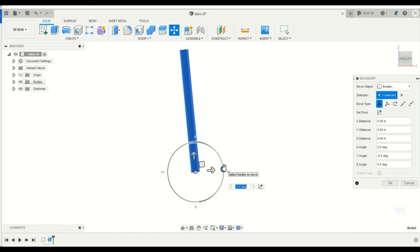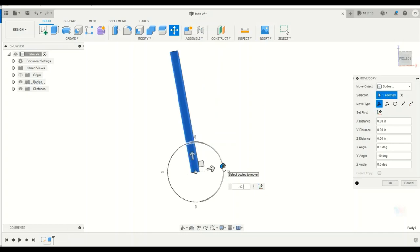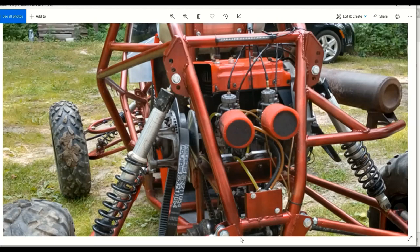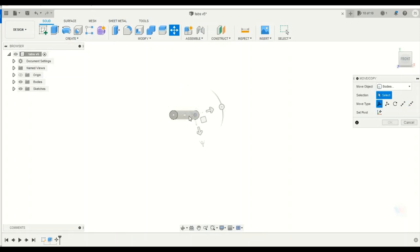I need to rotate it 10.8 degrees this way, negative 10.8, I guess, to match the angle between the vertical here and the tube. Now the tube is also pushed forward by, so I want to push the top forward, so the top, it's also pushed forward